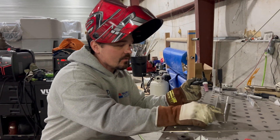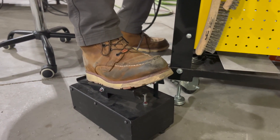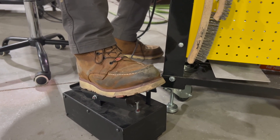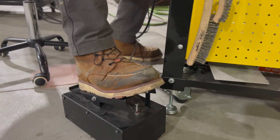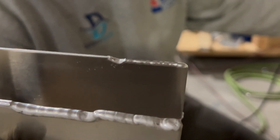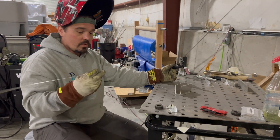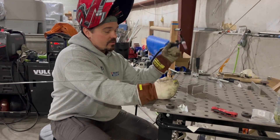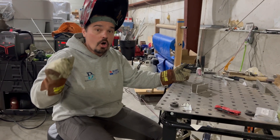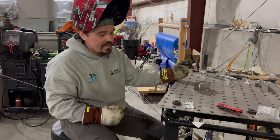Same drill on a really, really thin piece of aluminum. A little bit harder because it's such a thin piece of material that once you start melting in there you kind of have to keep going with it. It sunk in pretty good at the start. Now we're going to run a bead all the way the rest of the way across. As this thing gets heated up you're going to see my foot doing a lot more, and I'm just going by feel. My machine is turned all the way up — I could make this easier on myself with less amperage, but I'm barely using my foot pedal here. It's all by feel. Here we go.